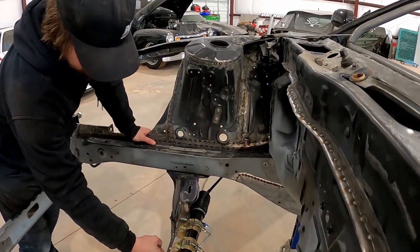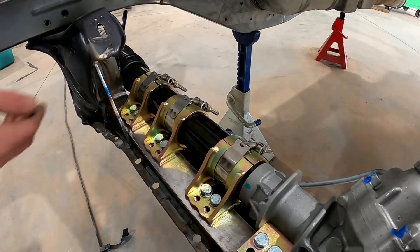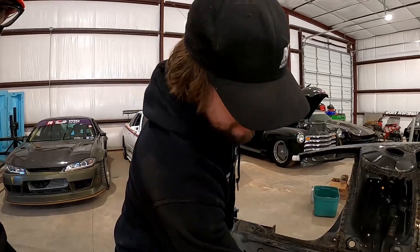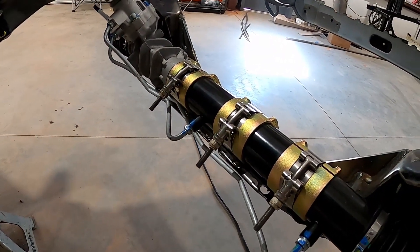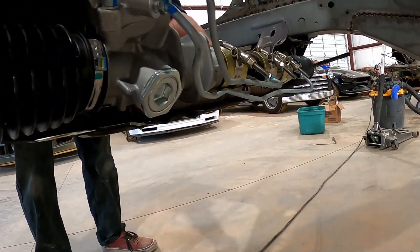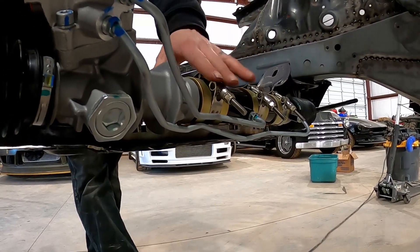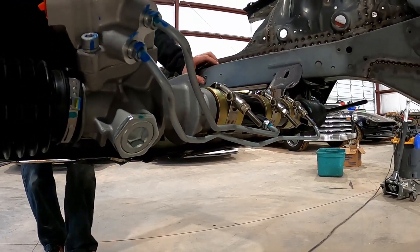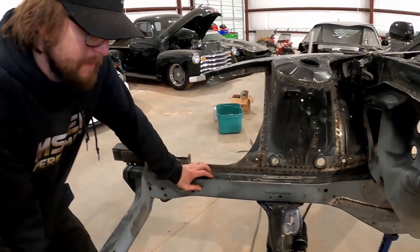This is a really neat piece by PBM - it's completely adjustable. There are actually four rows of screw holes so you have forwards/backwards adjustability. There are also different spacers you can stack in here to lift it and make sure you're getting the proper bump correction, in line with your lower control arm. Because it is in clamps, it gives you the ability to tip if you need to, so you can set that angle. It's got a really thick middle plate so it's not going to flex while driving. If you do get in an impact, you're more likely to snap these clamps than damage the rack or the subframe - that means hopefully we're just changing clamps, not changing a subframe or a rack, and that can be the difference between winning and losing on a weekend.